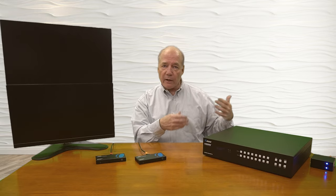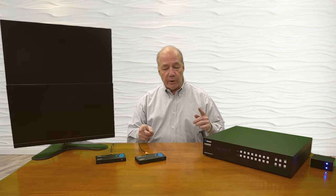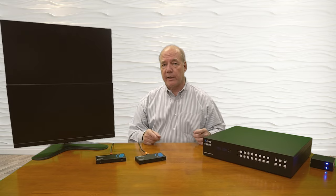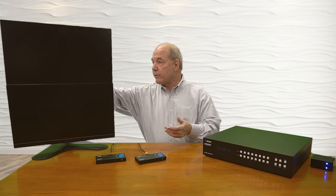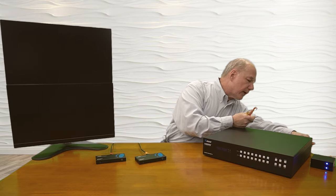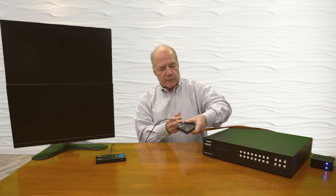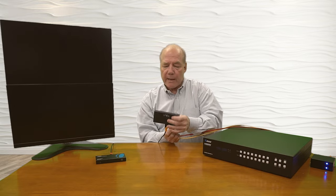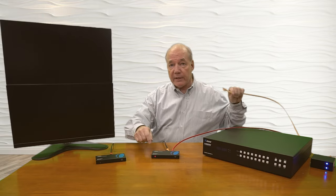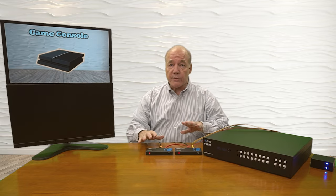The minute I turn it on, it's starting a power-on self-test. You'll hear a beep in a second — that indicates it's passed its power-on self-test and it's ready to use. You'll also notice the display is on in the front. Now there's no power in these remote units yet — the only connection I need to make between the two is a LAN connection, and that can be up to 150 meters away over a standard Cat5e, Cat6, or Cat7 cable. Because I'm short on table space here, I've got shorter Cat6 LAN cables — I'll plug the yellow one into location number one and the red one into location number two, then plug these into the back of the modules. Now the minute I plug this in, watch what happens on the front — see that LED come on? That's showing you that power is now being sent to that remote module from the main unit. Let me plug the second one in as well — both of these are now going through a power-on self-test, checking the electronics, checking the resolution of the media being sent, checking the resolution of the monitors, and making whatever adjustments are needed to give the best possible picture.